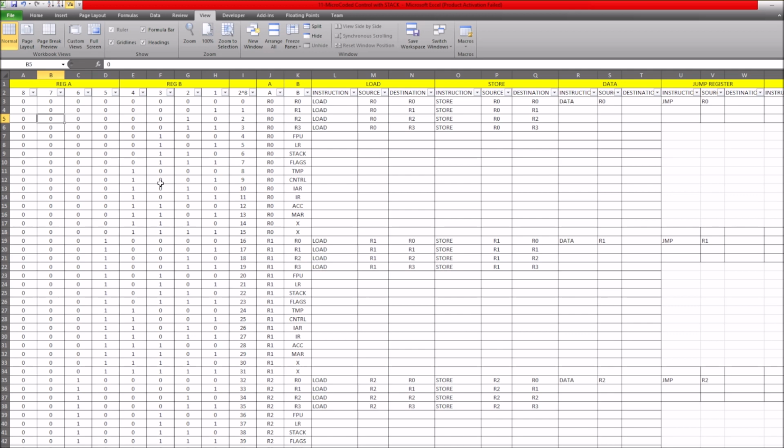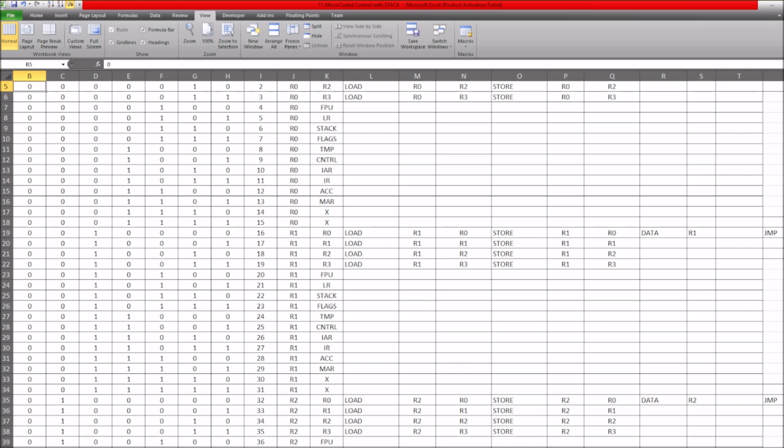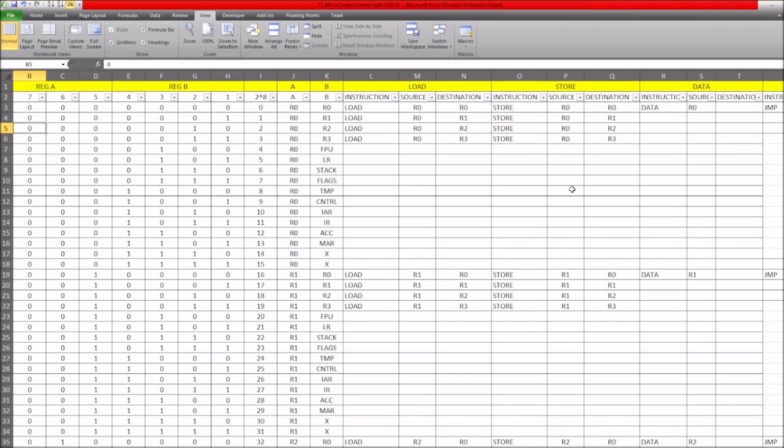And also the data command will have all these 256 available to it. And so will the add command. And every single command that we generate, every opcode that we generate, will have these 256 possible connections available to it. So this makes it so we can generate a really neat and very general control register that will allow us to generate just about any instruction you care to think about. And that's really what we want to be able to do.